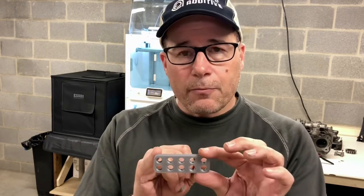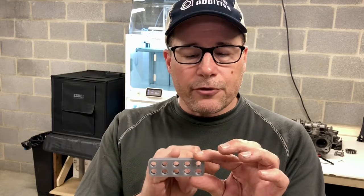In CAD, I will ask for hole sizes of 8.0, 8.1, 8.2, 8.3, right up to 8.9. I'll do one of these for 8s, 6s, 10s, quarter inches, and whatever else. Then I run these prints, measure the hole sizes, and understand which hole is truly the target size, comparing that to what I asked for in CAD.